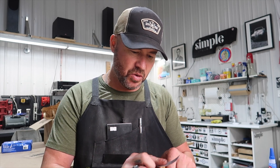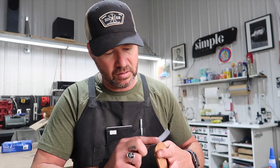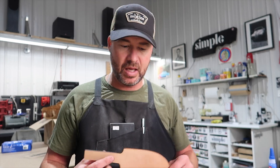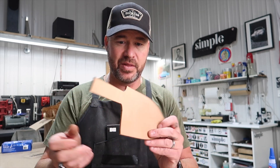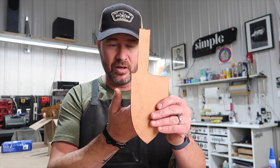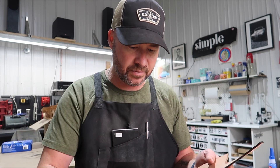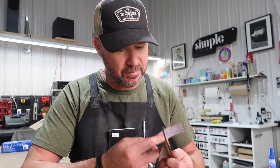For me this has been a longer process than I thought to get my templates digitized, but that's just because I don't use drawing software often at all — I'm actually really bad at it. But a little clunking around and I can do it. What I generally do is I'll take a picture of the knife, bring that into SketchUp, use the layout feature, and then just kind of draw curves a little bit wider than the belly of the knife. You can essentially just match the curve of the knife with this line here, then copy and paste it, flip it 180 degrees, line it up with this edge, and now we've got a sheath. Like I said, I'm not fast at it, but it's not hard to do.